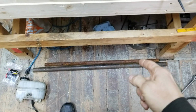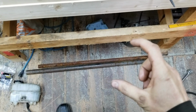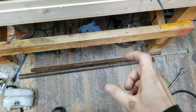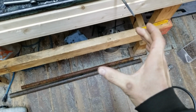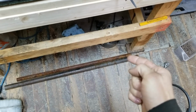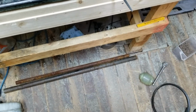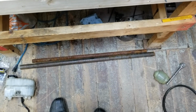And then Kyle also needs some frame reinforcers for his steering box. They're basically sleeves that go inside your frame, and you run a bolt through them, and it prevents you from crushing your frame when you tighten it. So I'm going to make him like 4, maybe 5 of them. He only needs 3, but I like to do a little extra. But yeah, I got a little bit to do. I'm very excited to get started.